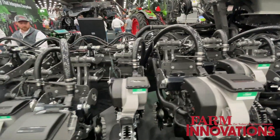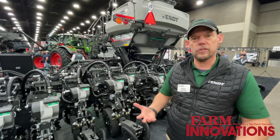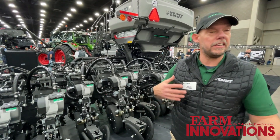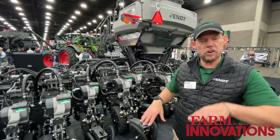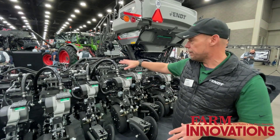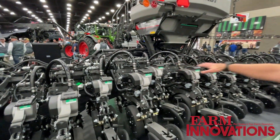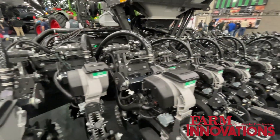So that's why the 30-foot. I want to show you the VCT — our Vertical Contouring Toolbar. The idea is we're able to follow the terrain better than any other planter on the market. We do that because our toolbars are set back and they're independent of each other. If I look at this left wing, this toolbar is a different height than the center and the other wing.